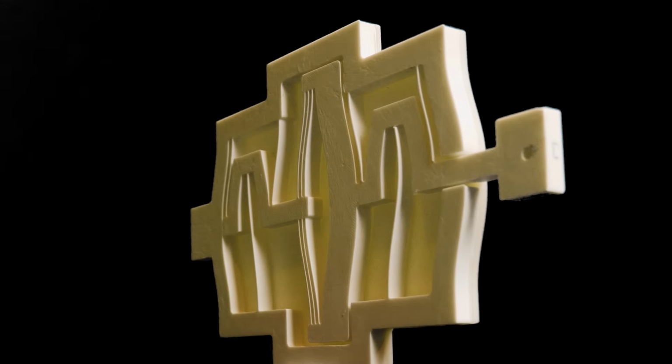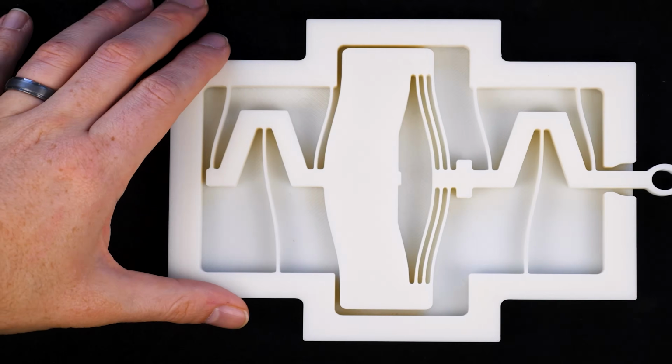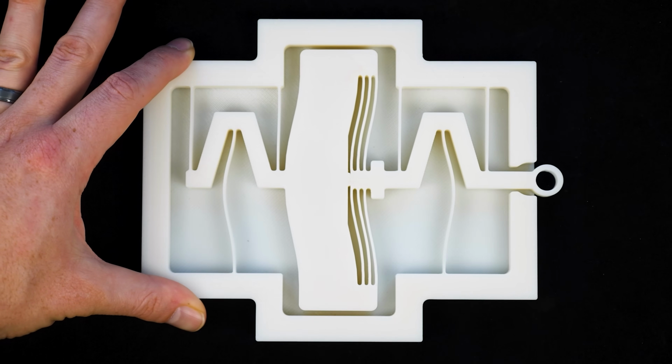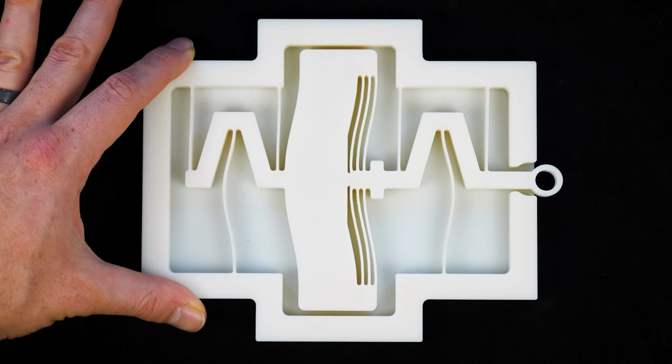This is a binary stiffness compliant mechanism that can be changed from a stiff state to a compliant state and back by triggering a bistable switch at its center. When the switch is extended, the mechanism is stiff, but when the switch is triggered inward, the mechanism exhibits near zero stiffness due to principles of stiffness cancellation.